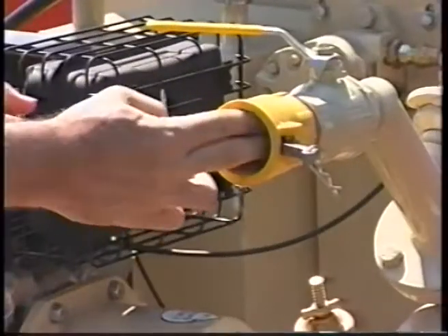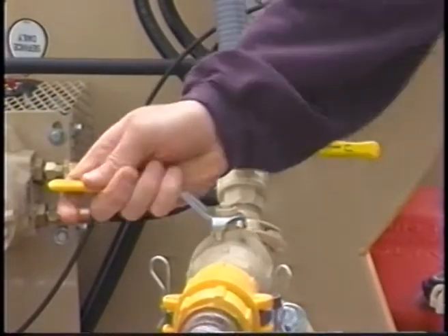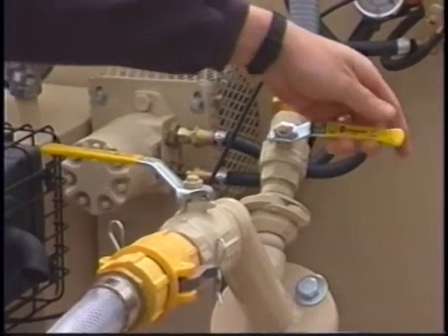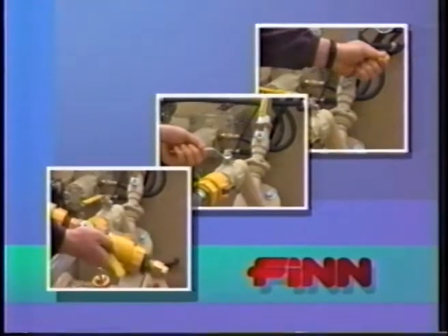The spring and pressure disc will force lubricant to the pump seal as needed. Now check the nozzles and hoses, making sure they are free of any obstructions. Check all valves for free movement. Your hydroseeder is equipped with three independently operated ball valves for control of slurry. Each has an important function. The first is the recirculation valve, which allows slurry flow back into the tank. Next is the pump discharge valve, which controls the slurry flow and directs product through the discharge hose. And finally, there is the remote valve, which connects to the end of the discharge hose.